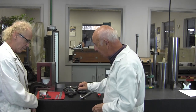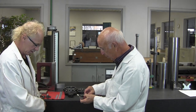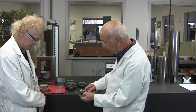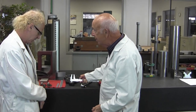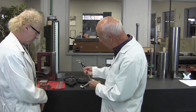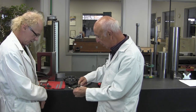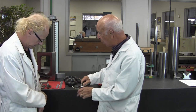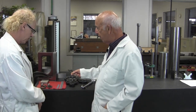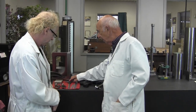Likewise, with a dial caliper. They've gotten so inexpensive anymore, they're just great. What I like about it is you can measure inside, outside, and depth with this. So it's really a versatile tool, and you can lock it. They used to be three, four hundred dollars, but the prices have come down dramatically. Plus they have digital versions now. We're just here to point it out.